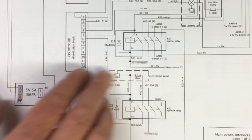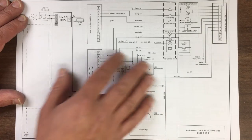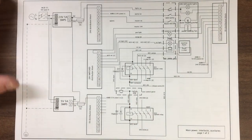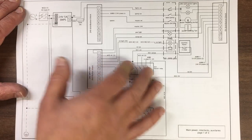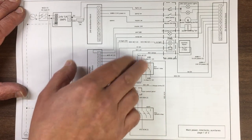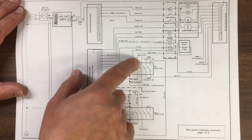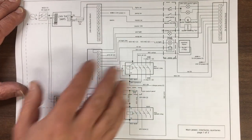I quite like to do it manually, so I've got that. I think that's kind of it. I won't go into detail here, but you can have a look at it yourself there. Basically this energizes everything, enables everything to go. It sends an e-stop OK to the motion control system. It allows you to power the contactor, and it does a self-latching function as well.